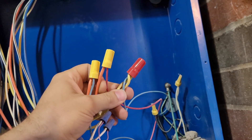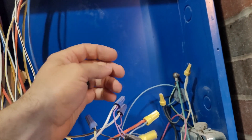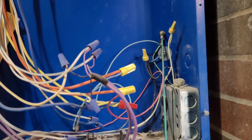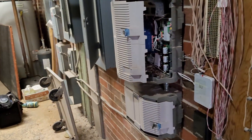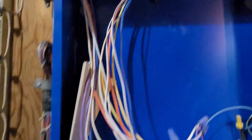I'm going to take this blue, this red, and this other blue, and tie them all underneath one wire nut. We'll see if those relays come to life and in turn all of our thermostats come to life. Yeah — that's what you call red wire control, typically controlled by a time clock in the old days.